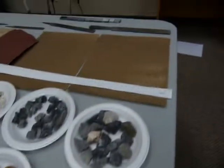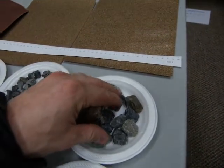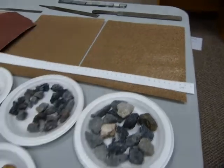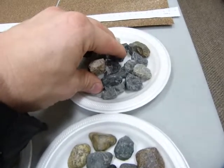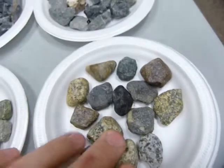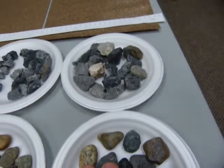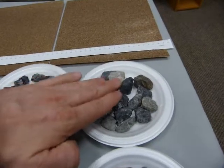What this represents is that when you start working with a certain grit of sandpaper, the abrasives in it start as sharp as they are represented in crushed rock, with jagged edges. As you keep working with a certain grit of sandpaper, what happens to these crushed rocks — what happens to the abrasive material — is that all the individual particles get rounded down or fractured, and naturally the rounded and worn abrasive doesn't erode material nearly as effectively as the sharp ones.